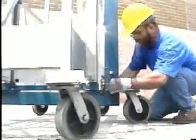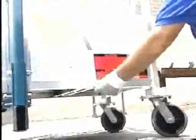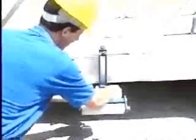If you are using a walk-through stirrup, attach a stabilizer wheel so that it extends outward away from the platform. Tighten the 2 large and 8 smaller nuts and bolts. Now, install your floor sections and retain them with your floor pins.